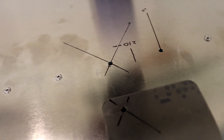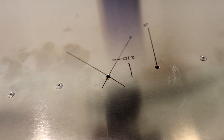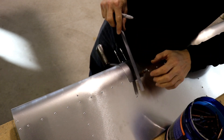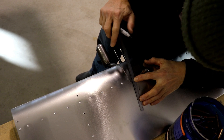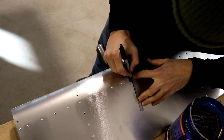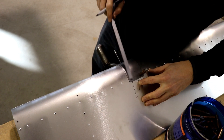So now when I put on my counterweight here, I'll redraw that line, measure up two inches, and the end of that line should be right where that hole will go. Hopefully you can see this in the camera, but I have that two-inch line drawn and this clecoed back on. I'm going to put the ruler exactly on that line — I'm starting at the 10, going up to the 8 — and redraw this line on here. Right exactly where it ends is where I can punch a hole.